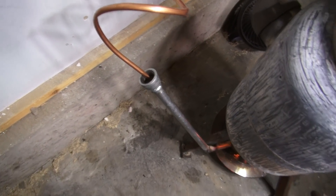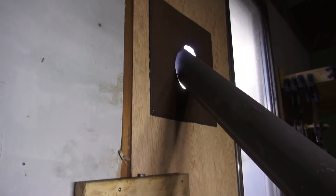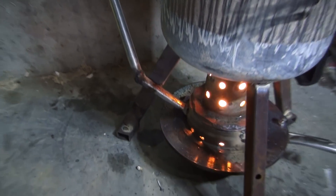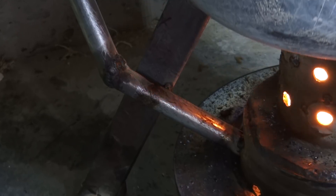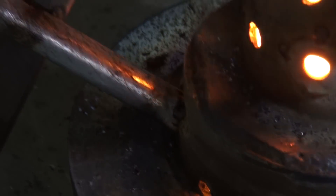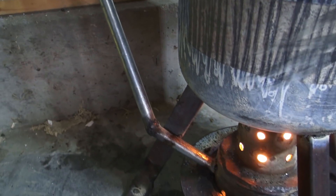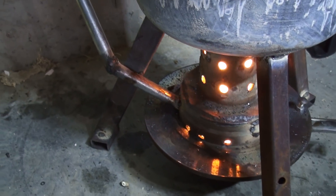The whole system is completely serviceable and completely mobile — it's not bolted down, which is maybe a safety concern, but it's not going to go anywhere. It can't tip. I built the drip system using a heavy pipe — a real heavy pipe — and I welded it in place to try and dissipate heat from the steel leg. As I increase in height I also increase in distance to dissipate heat, so I don't want the oil to burn back into the pipe. Having a heavy pipe gives me more confidence it won't backfire — although it's unlikely anyway, this way it's definitely not possible.